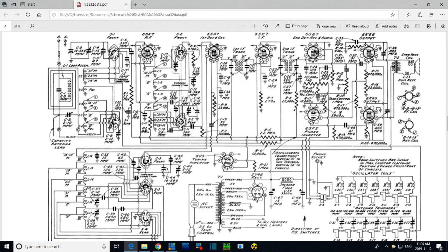Now another one I'm doing is C24. This is the one that's in the middle of the radio, if you like. And there's where it says 0.1. But in fact, I'm pretty sure, maybe I'll be surprised, but the capacitor that's in there sure looks like a 0.05 to me. And the last one, number 22. That took me forever to find it. It's installed right around this tube, C22. But on the schematic, C22 is way over here somewhere. It's way over here. 0.05, which is what I think it is, a 0.05.